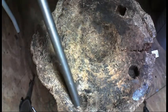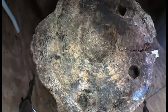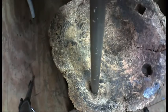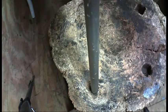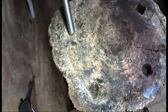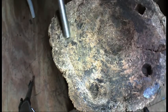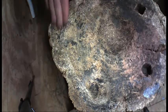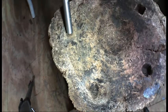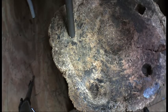This one is what I primarily use. Let me move the camera back a little so you can see it better. It's got about a 3 by 3 inch dishing area that goes down about an inch to an inch and a half. That's where I do most of my dishing - I call this my medium dishing area. You can see how it's sloped around from all the dishing. This lighter dishing area is a very shallow depression - I use it mainly for some finishing dishing or if I have to go back and dish something later.